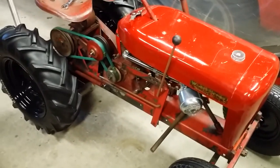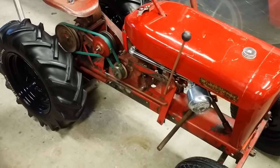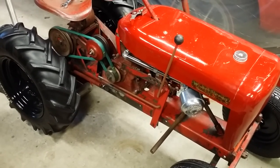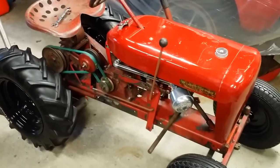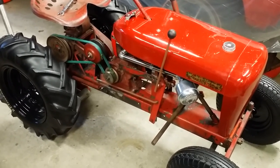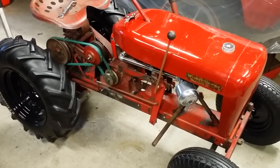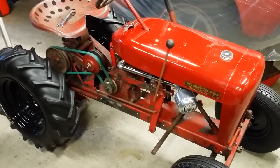This is a tedious process if you want this thing to run very smooth and work like it was intended. It takes a lot of time — a lot of shimming of the vari-drive, adjustments to the speed selector, and the adjustment rod pivot. As you would see in the attached video below, it's a constant back and forth between adjustments and sometimes belt lengths to get this system to work smooth as glass.